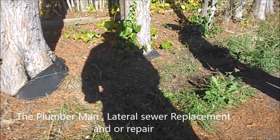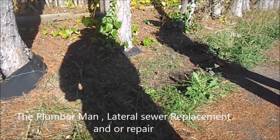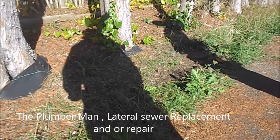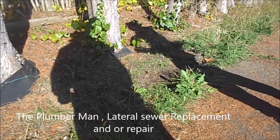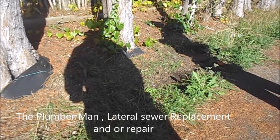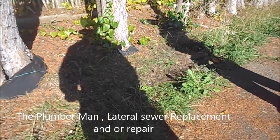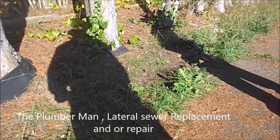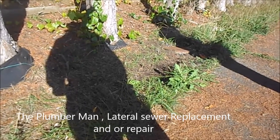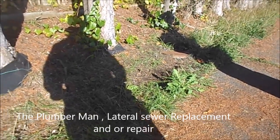Plus a day of labor. You also have to dig the trench correctly — you can't have a wavy trench, it has to be perfectly sloped, otherwise when you backfill you'll get bellies in the pipe. The best sewer line is done by the person who can do the best trench. If your trench sucks, your plumbing will suck. If your trench is awesome, your plumbing will be awesome. I get intense about it — I shave the trench, pack it, bring my tamp, and get it solid so whatever you sit on it, it's done and you'll never have a problem.